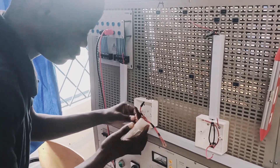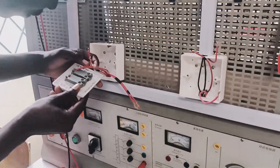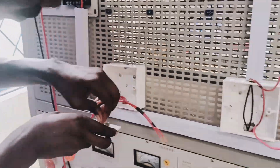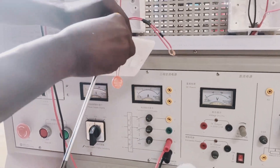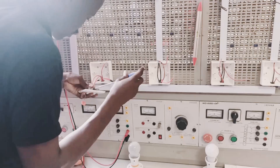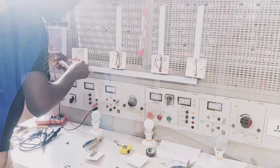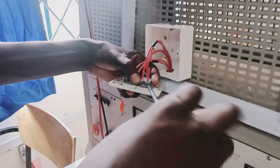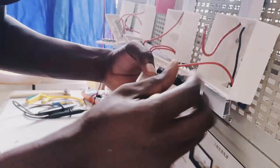Then the last two-way one-gang switch is acting as a one-way one-gang switch. So the termination is ongoing. I'm connecting the two commons together on the first two-way two-gang switch. The first gang will go with the two-way one-gang on the second switch, and the other gang will go with the third switch as well — so live one and live two at each end. To mark your live one and live two, you can use tape. The one I've taped with black is going to be live two.